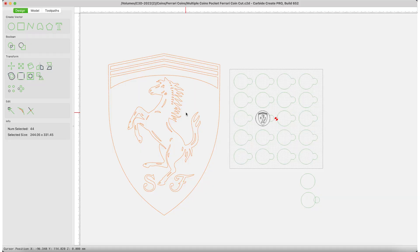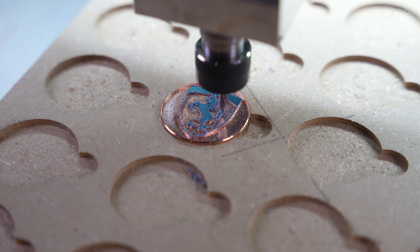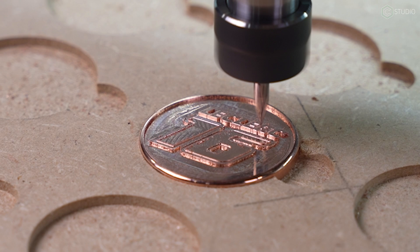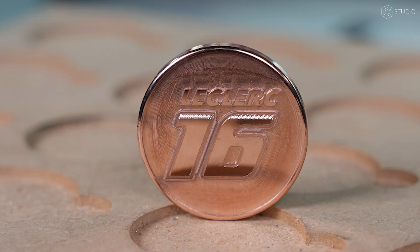With all that learning behind me, I decided to incorporate some art I had made before — the Ferrari shield sign you've seen behind me. I decided to take that art and put it on a coin. Since I already had the art complete, all I had to do was resize it for this project. This is where the PCB mills came in handy. I used the 40-degree PCB mill to add detail where the 1/32nd pocketing had not taken place — adding details to the mane as well as the tail. This also paid dividends on the back side, where I had Charles Leclerc, number 16, current driver in Formula 1 for Ferrari. The last three letters of his name were too close together for the 1/32nd to go in between them. I passed the PCB mill again with no offset along those contours, and it brought to life the details of his name.